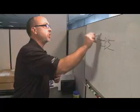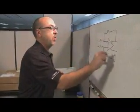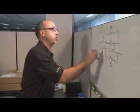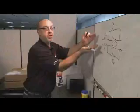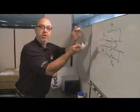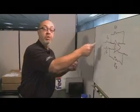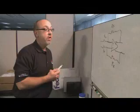We put resistors around it. With the typical resistors RG and RF to set the gain, we drive this differentially, and the input impedance looks like these two resistors. It's fairly easy to compute, and to match that, you can easily put a resistor across here to get the exact value you want.